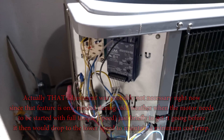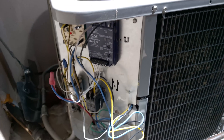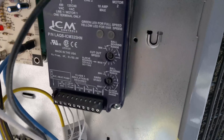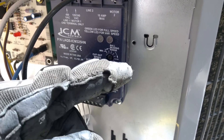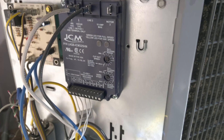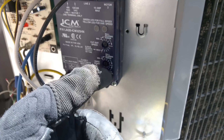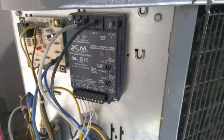These are cool because they have a sensor that monitors temperature of the coil — liquid line usually. You put it most of the way through the coil for a good reading. There are two settings: ball bearing range and sleeve bearing range. On ball bearings you can slow it down more because lubrication isn't an issue, but if you have a sleeve bearing you're not supposed to go lower than where this line is. Both of these screws were turned all the way down to the lowest starting torque and the lowest minimum cut-out speed.